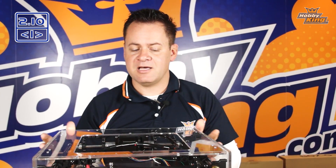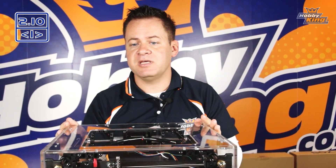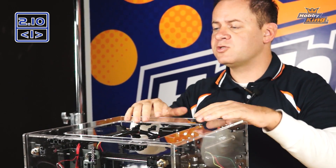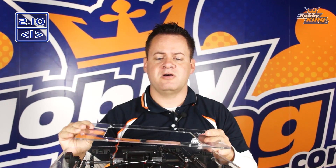The problem with this lid is now that we've got all four sides bolted together and nice and tight, when we go ahead and try and install this one, it's definitely going to be a tighter fit possibly, depending on how your printer was squared up. So to install it, you can go ahead and flex it just a little bit. It is acrylic — it will crack if you flex it too much — but you can give it a little bit of a bow to get it inserted in there.